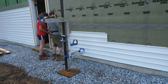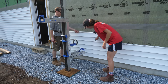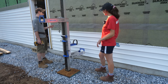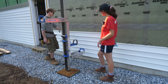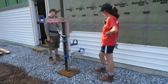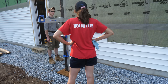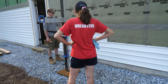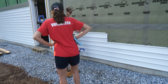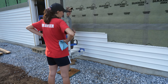I'm aiming for studs — you technically don't even have to hit studs, but I don't want random nails sticking out of the walls when we're putting insulation and wiring in. The slots are inch and five-eighths on center, so you'll hit one dead center in the middle of a stud, but when you get to the next stud the stud is right through the plastic. So I'm taking my utility knife and trimming that plastic out to make one long slot. Technically you're supposed to use a punch and only elongate the slot, but I don't really care — I'm just doing it anyway. The cut goes on top first, because if you do the bottom first the piece is really flimsy.